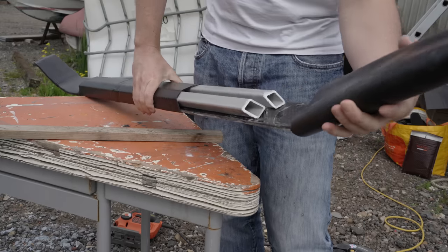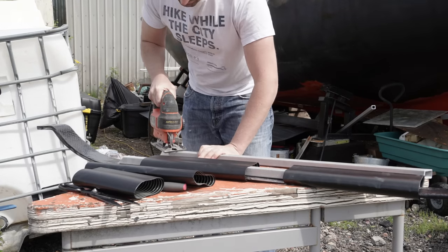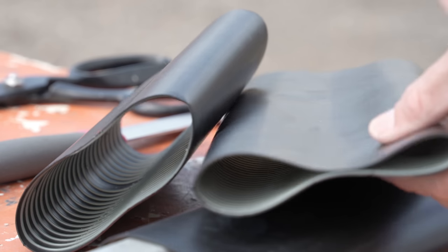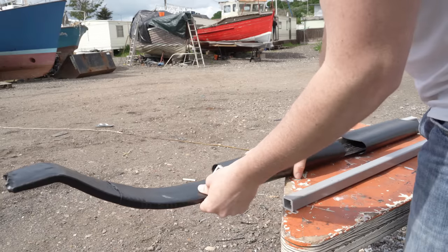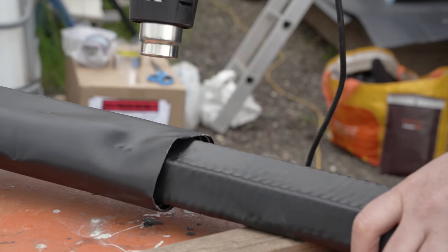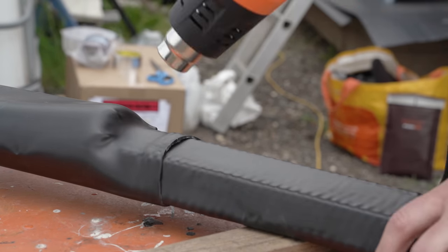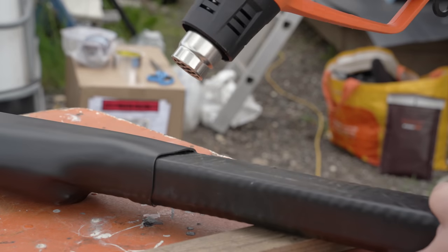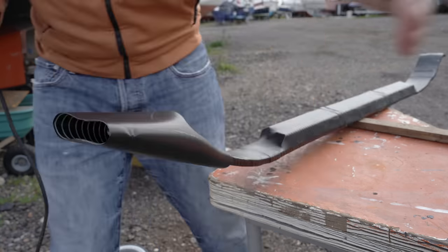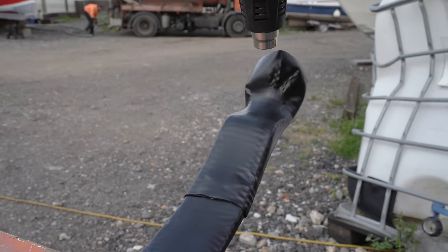And the front bar was complete. I added some lightweight box section as there was still a little bit more flex than I wanted, and then time to do a wrap. I've used heat shrink wrap on grab handles to good effect previously, so I got hold of some extra wide stuff — though I noticed it can be tricky to shrink uniformly. I couldn't get the whole length around all the corners without getting jammed, so it has to be done in sections. Heat shrinking can be quite satisfying, but this heavy-duty stuff with glue lining is a brute to get back off if you mess up. Complete.